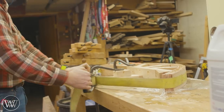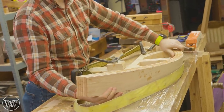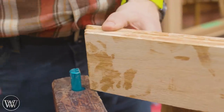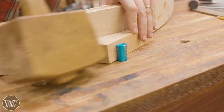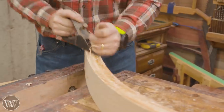Using the strap to lock everything in place — once it's loosened up you can see that's the total amount of back-bend, really wasn't much at all. There's our piece. Now we need to plane this down to thickness: it's about three and a half inches wide and I want to take it down to about three inches wide.